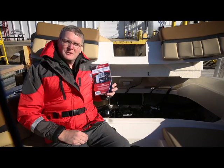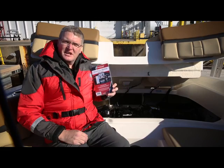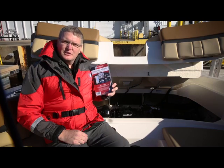Today I'd like to talk to you about how to install the VesselView mobile module on your single engine MerCruiser stern drive or inboard application that does not have SmartCraft architecture already installed. In order to do that, we'll locate the 10-pin SmartCraft connection on the engine and install the VesselView mobile module into that location.